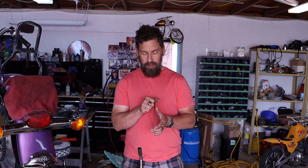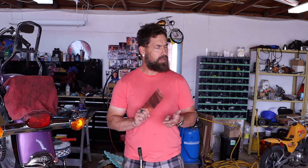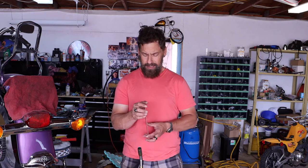This pipe in particular, they have designations on pipe. It's KLM and DWV, I believe it is, drainage waste vent. Yeah, DWV. So it's super, super thin walled. Well, I ended up finding a piece of K. So it's extremely heavy walled. I don't know how that factors into it as far as heat retention. I assume it would probably have more heat retention just because of the sheer physical size of the copper. So it makes it pretty heavy though too.